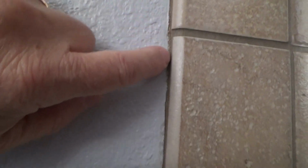And when I was right in the middle of this, you might have thought, does he really know what he's doing? I'm not sure if he knows how to cut this all in right and get all the paint off of the grout lines, and how's he gonna do that? I even put masking tape on there, but then the paint went down on the inside of that because the grout was right there, and there's no way, I don't care what color masking tape you put, you're not gonna get it perfectly. So then you spend the extra time cleaning everything, your paint excess off, and then cut in and check everything again and then clean off any excess. And that's what I ended up having to do for these grout lines to look so nice up next to this painted edge.